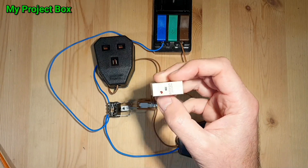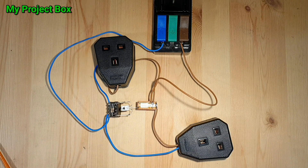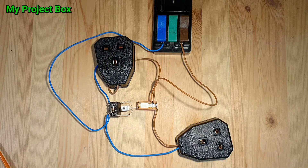There are various relay options I could have used, but I'm going for this nice mini relay rated at 16 amps. It's very small so it'll fit inside the power strip easily — it's a PCB relay but we're soldering straight onto it. Another option would have been a 12 or 24 volt relay, but the problem is it needs a 12 or 24 volt power supply. I think it's more elegant to just use a 240 volt relay. It keeps the circuit very simple — just a relay, a triac, and this diode configuration made up of bridge rectifiers that gives the volt drop to trigger the triac.